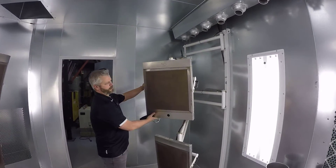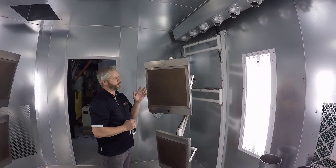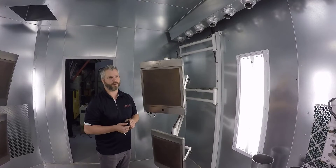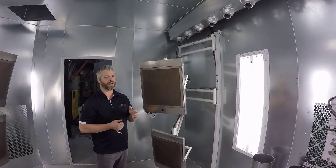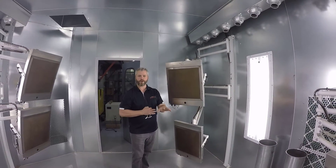There are two ways to operate the Sunspot units. We can either run it by percentage of power, which is very common in a room — say a 12x12 booth with three lamps — where we're potentially at 30% power to achieve our surface temperature of our coatings.